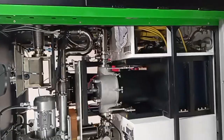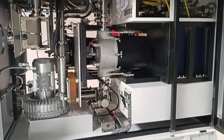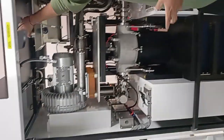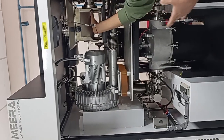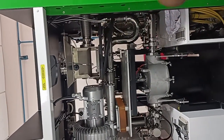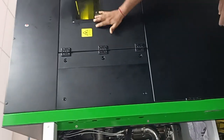If you can see in that tracking conveyor, you can see the silos that are pressing down. Once we are done with filling the silo with powder, we mount it over here and with the help of control valves, we collect it over this hopper. We have a screw feeder over here, so the screw feeder continuously rotates and feeds the powder to a unit called re-coater inside this.